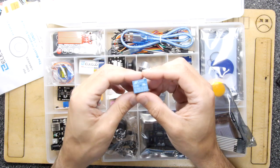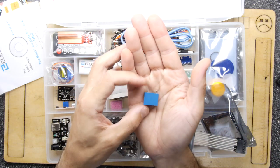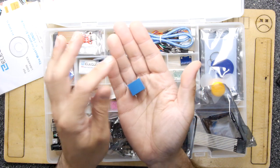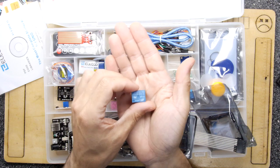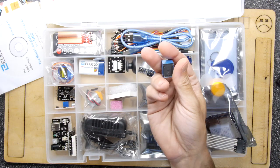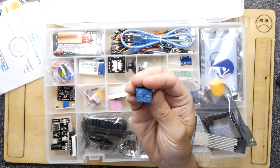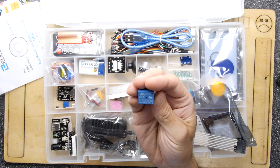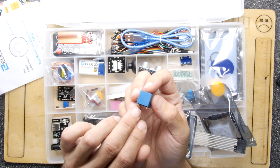You have a 10-amp relay here rated at 5 volts, which is quite handy since you can directly operate it. Interestingly, 3.3V relays were hard to find, and even 5V ones were rare enough. You could technically do a mains project with it at 250V AC, but be very careful with your PCB tracking — you don't want a mains arc shorting something out, and definitely not shorting yourself.